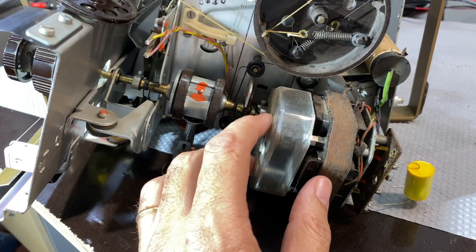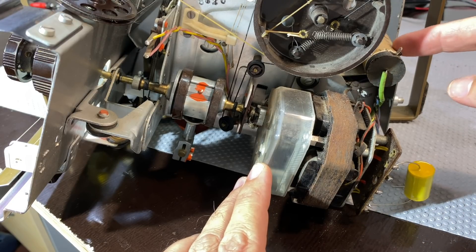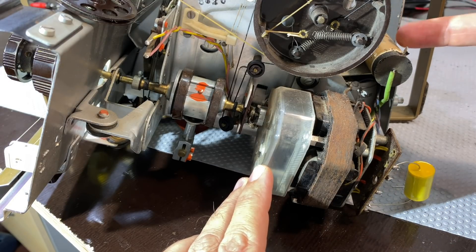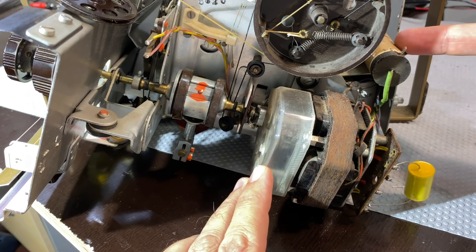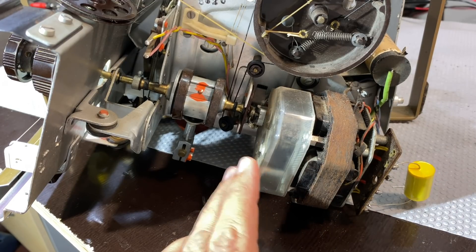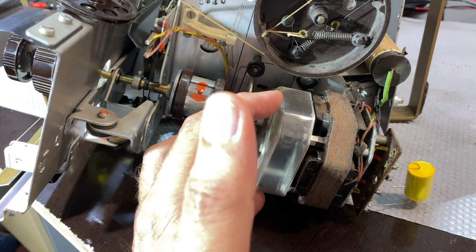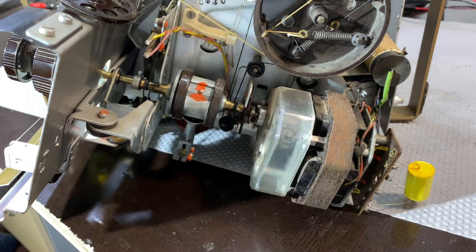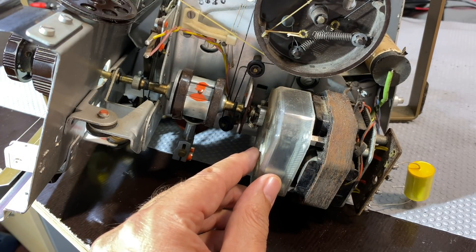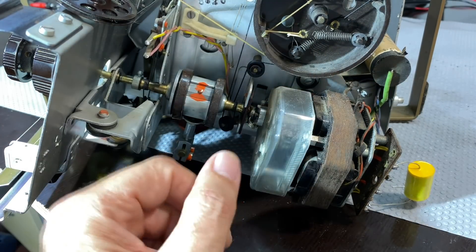I may have to go into a lot more detail if this thing is not working. I've got this capacitor here — basically replacing that one. It's 0.4 microfarad; this is 0.47, close enough. This is across one of the windings. Before I put this one in, it was doing exactly the same. There is a motor capacitor which I'll show you in a minute. But I think this could just be a matter of lubrication — I may have to remove this whole thing and clean it up properly. I've done it before; I did this on my Freiburg 8. I dismantled the whole thing and cleaned and lubricated everything. But I'm not sure that's going to be the case here, because one of these windings — these motor stators — one of them might actually be burnt out.